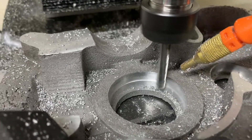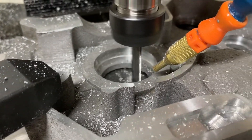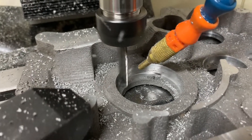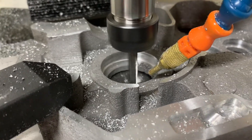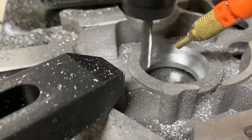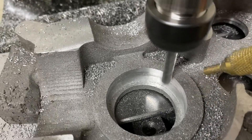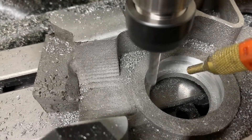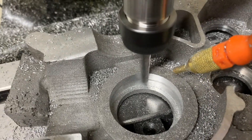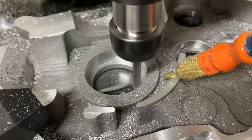The plan was to roughly interpolate all of the holes leaving 1mm of extra stock to come through and clean up accurately with a boring head. With that 1mm of stock to leave, I could also come through and check all of the bore centres to make sure they were accurately spaced. According to my digital calipers all of the bearing bores were accurate to 0.01mm. The only extra precaution I had taken to achieve this accuracy was to carry out a spring pass to remove any stock left by tool deflection.